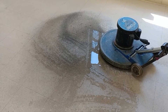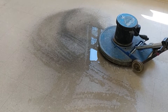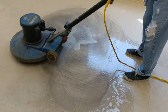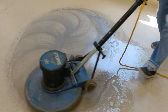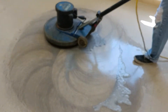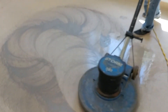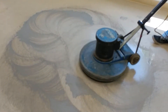So what we're going to try to do is get all this dark junk out of the tile and get this all cleaned up so we can start getting some wax put on this. They've got a new company moving in. One of the ways we can do it is with this low-speed machine here. We've got a good solution of a scrubbing cleaning agent mixed with water. Because the chair that was sitting here — they had a desk here, you can tell — the wheels in the chair ground all of this dirt into the tile as it ate all the wax up.